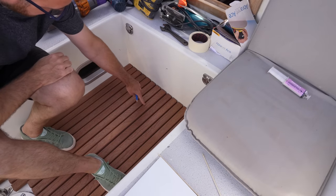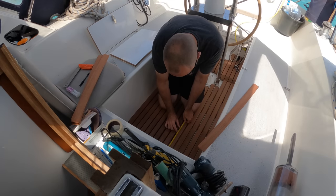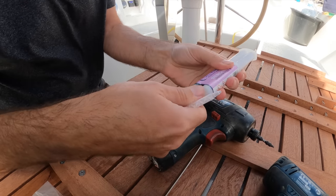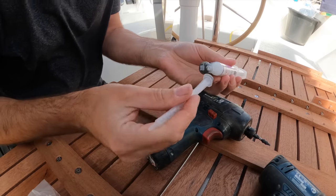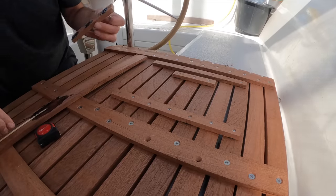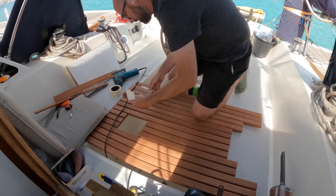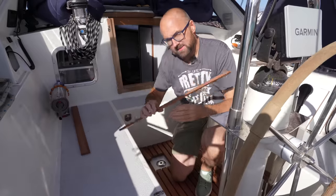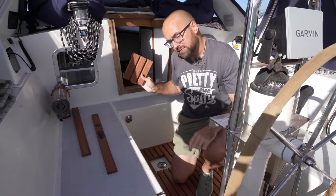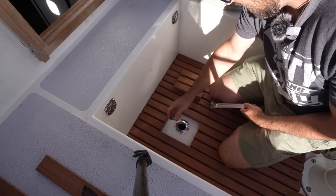If I add another support here and down here I should be able to just cut out this section and have access to the deck fill. I grabbed a couple of quick measurements to get the opening in the right spot, drilled all the holes, and got all the screws started. Using a bit of five-minute epoxy should make sure nothing comes loose — the epoxy came with a fancy mixing tube that didn't work at all, so I ended up mixing it the old-fashioned way with a bamboo skewer. With all the supports glued and screwed in place I flipped the grate over and cut out the small access hole. The very last thing was to epoxy some little spacers to keep everything centered. The next morning the epoxy had set nicely — we now have a tiny little access hatch for the deck fill, and with this piece removed there's just enough room for a winch handle to get in there.